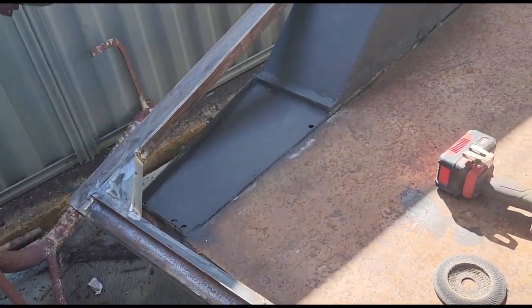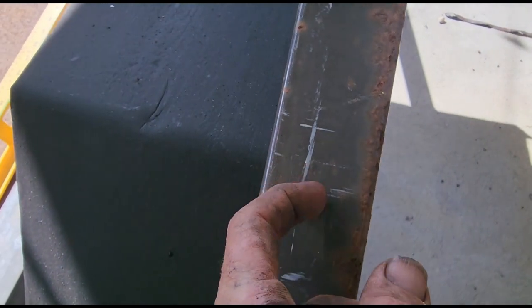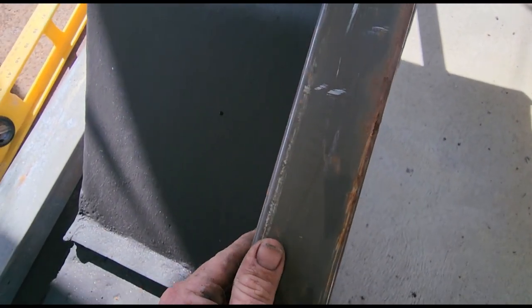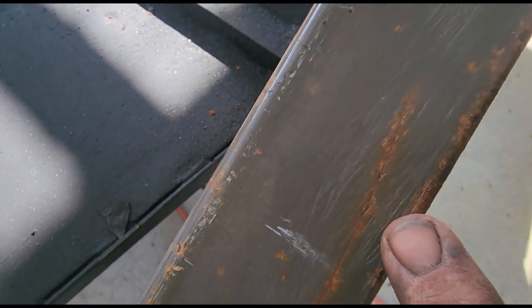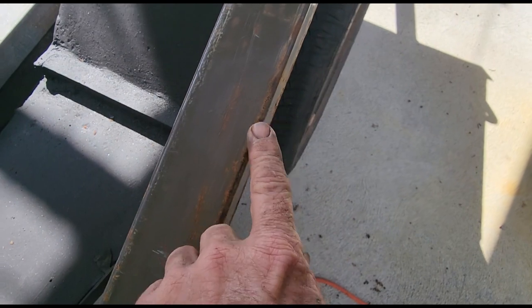She's a bit rusty. This steel, you can see, has surface rust, but on top of this stuff it's got a clear lacquer coating, which is absolutely horrible for the flap disc. It's even worse for the wire wheel. You can see where it's gouging the clear coat off it. It's supposed to protect the rust, but it's got through.